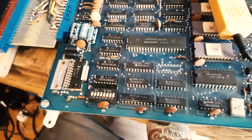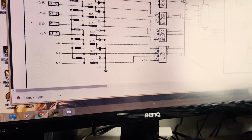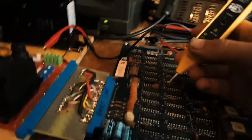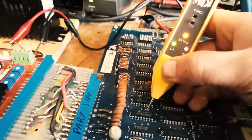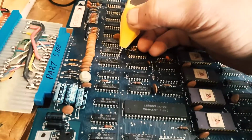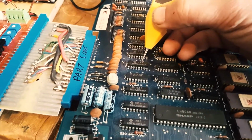So we can actually try that. The input here for these should be, so we're looking at 2J12, this is ground. We'll assume this is 11 here. 11 should be low anyway. So this is 2J, this guy should be high, sorry. So yeah, this is high. The input here, 12 is the input, and 12 is actually toggling high and low. This is low, and this is high, sorry. This is the output, and the input is toggling high and low.